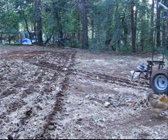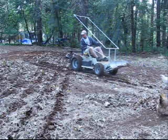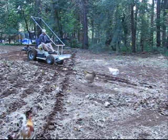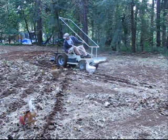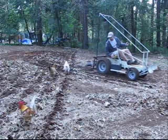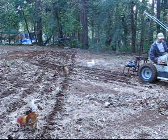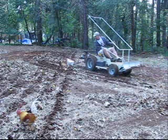When converting a garden tractor to an electric tractor, I built a machine to do the work that I needed done. The batteries are the main weight contributor of the electric tractor, so why not take a hindrance and make it into an asset? Mount the batteries as low as possible and centered evenly between the front and back wheels. This will make the machine very stable with great traction, and the wheels will be less likely to sink in on soft ground.